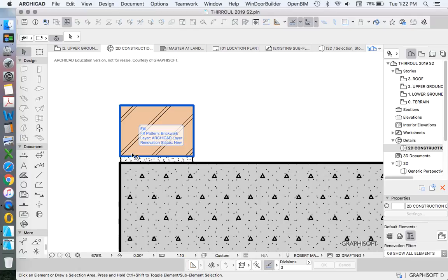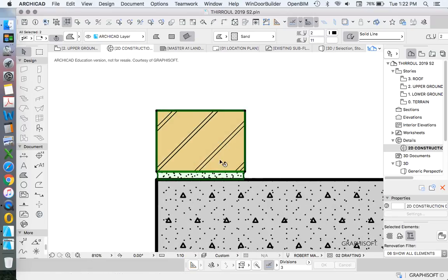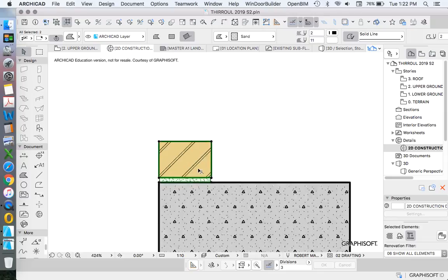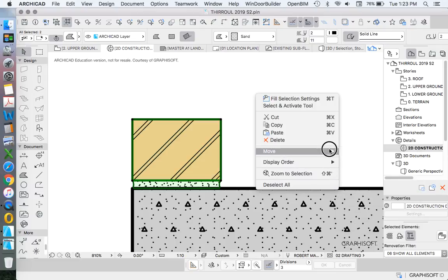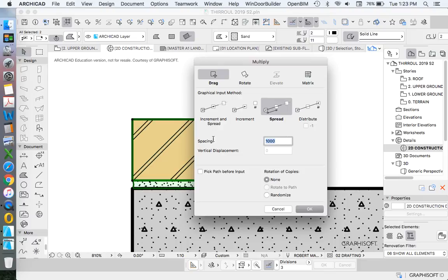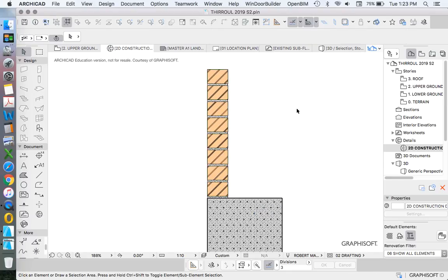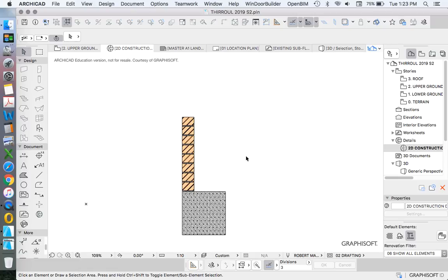Now it seems like we've done a lot of work to draw these fills, but the good news is that once we've done a little bit of work and done it really well, our life gets much, much easier. So let's say we don't want to draw 1 brick, we want to draw 10 bricks. Can everyone watch this, please? I've got 1 brick and 1 mortar. I could group them together if I wanted to, but I don't really need to. I'm going to right-click, move, multiply, and I want to spread 86 millimeters because that's a brick plus 10 mil mortar, and I've now got a wall of bricks. So once we've drawn something, multiplying it becomes incredibly easy. It takes a little bit of work to set these up, choose good fills, choose good pens, get everything drawn millimeter accurate, but once you've done that, life gets very, very easy from that point onwards.